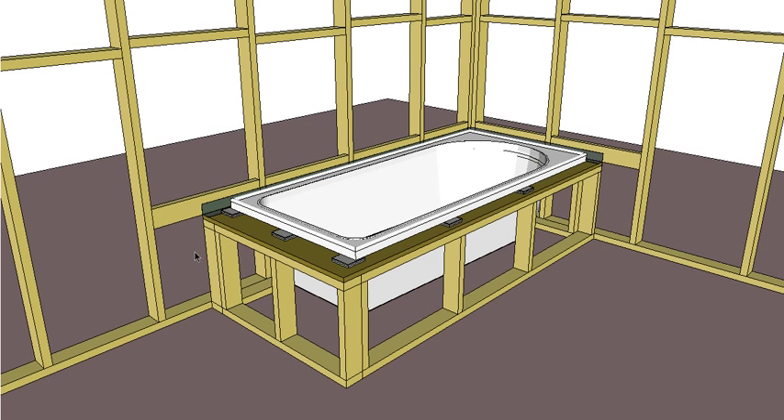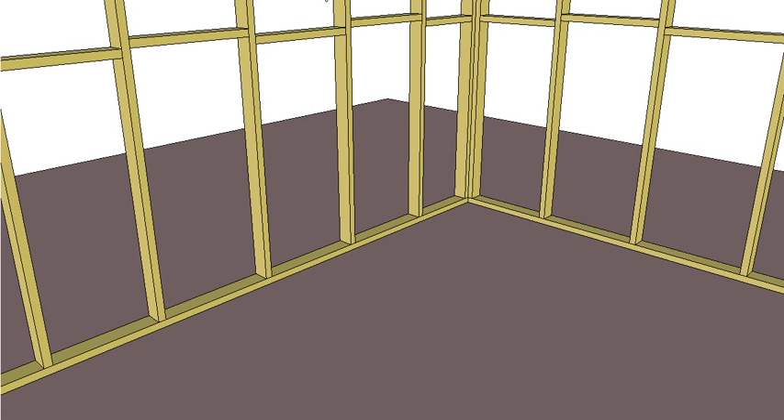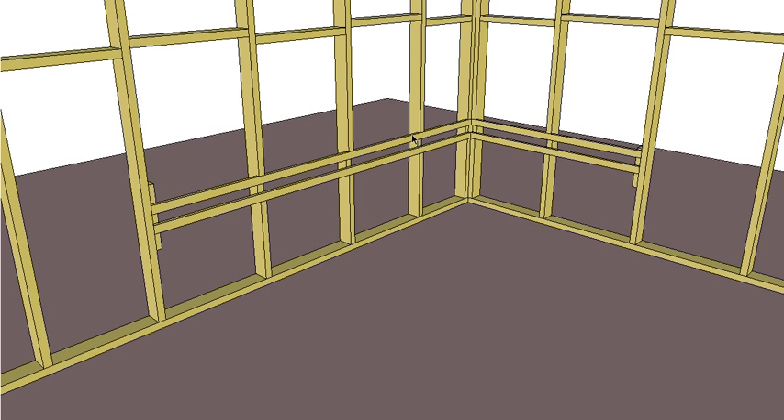You might also need to put a noggin in here just to take the sheet on the end — I'll show you that with the next example. The other method is where we actually cut the bath into the wall, so we trench out of the wall. The timber framing code in Australia allows a maximum depth of 25mm for these cuts — that's the only place we can cut 25mm deep, which is a single row of checkouts for our bath. Anywhere else we're limited to 20mm, but for our bath we can go 25mm. They still want continuous edge support for our bath, so we have to put in a piece of timber around here that the bath is going to sit on so the edge is continuously supported. And while we're at it we can put in another piece on top that will support our sheets and give us somewhere to screw or nail our sheets off to.